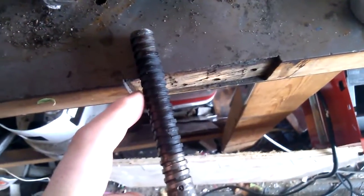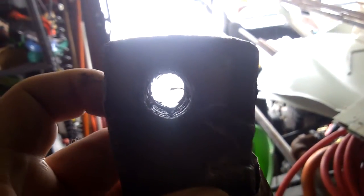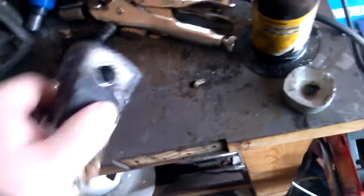Me being kind of a moron, I put this into the foam — I used lost foam casting — and I didn't put anything on this to prevent it from sticking. It took a little bit of effort to get it out, but I did actually get it out. If you look over here, you can see there's a piece sticking off the wall, and there's another piece right over here sticking out. It looks not so great inside. When I pulled this screw out, I did so with a hammer and essentially it stripped all the threads on the inside of that.